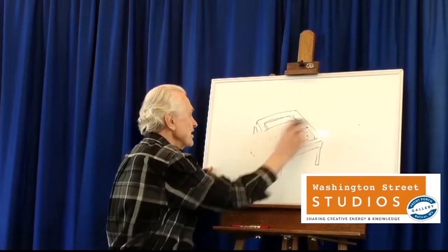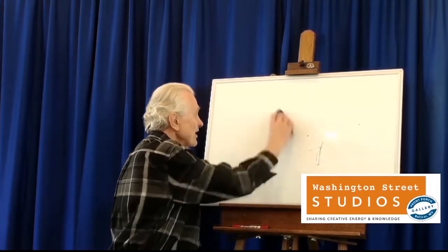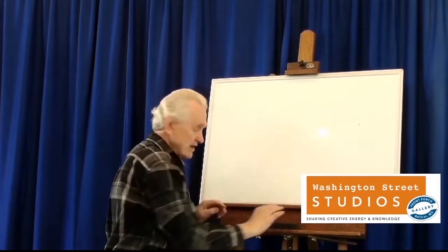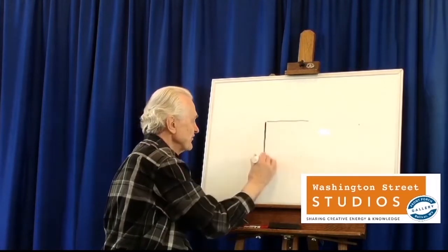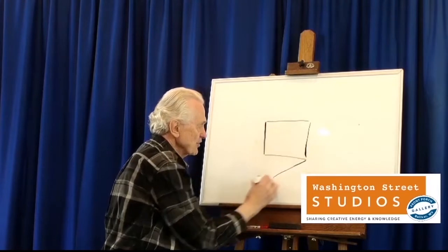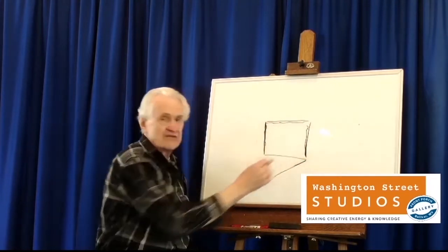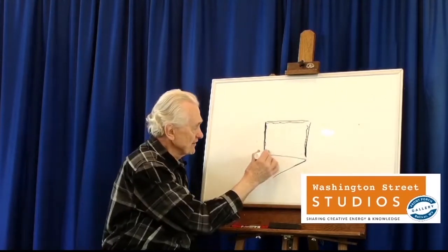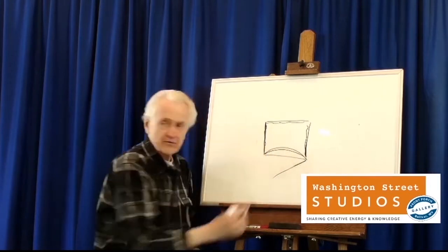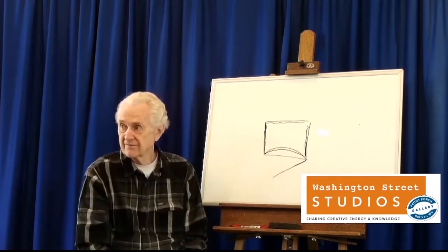At one of the places where I was teaching, we bought a couple of front-loading kilns, and I did some testing on them. It was a square body, and this was the door, but there were only elements on the back and the two sides. I did mapping with cones to look at the temperature, and there was a zone that looked roughly like that, that was colder than the whole rest of the kiln, all the way up the front, which makes sense because there weren't any elements in the front.